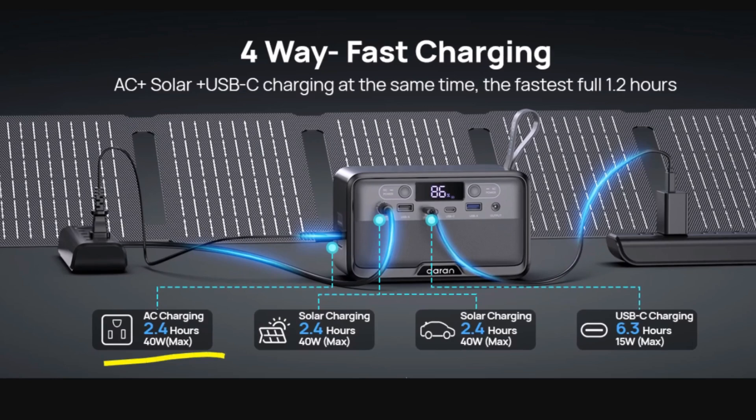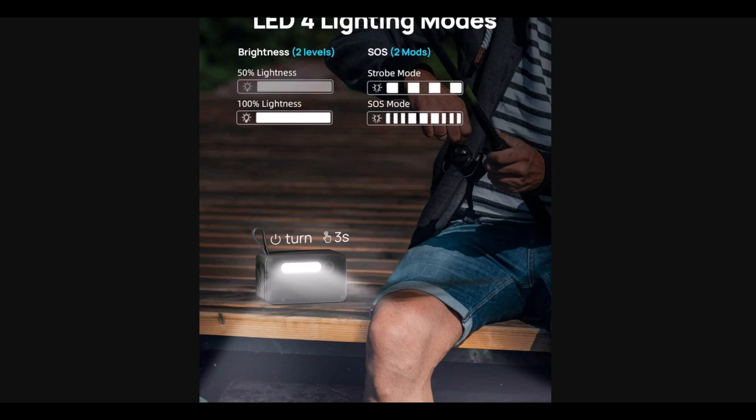You can combine multiple input sources — 40 watts from wall plus 40 watts from another source, and potentially even higher from solar if you use a 100-watt panel under 30 volts. It'd be interesting to see how much you can actually pull in. You can also add 15 more watts from the USB-C port on top of that.